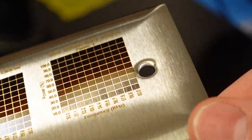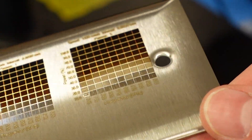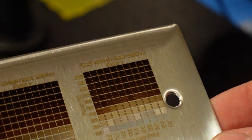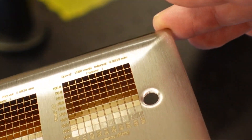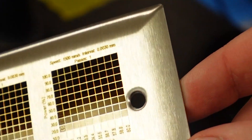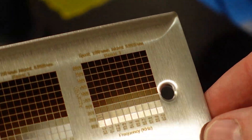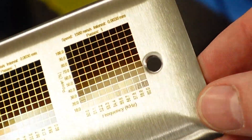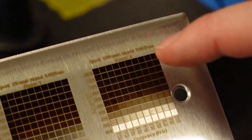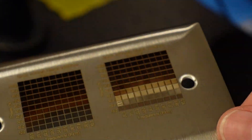With color on stainless, it's really about temperature and annealing. Even if settings work on one piece of stainless, a different piece with slightly different composition or thickness will absorb heat differently and give different results. It's very material- and environment-specific, but the material test gives us a good starting range for marking on stainless steel.